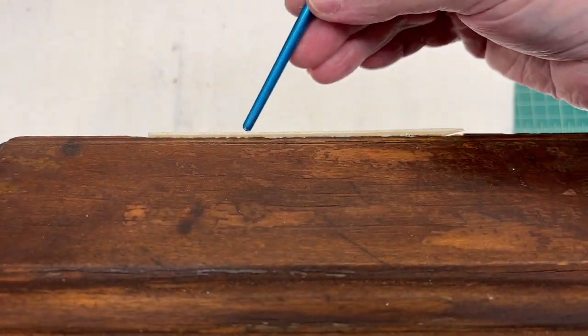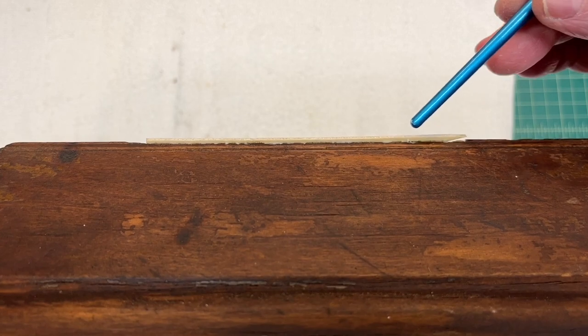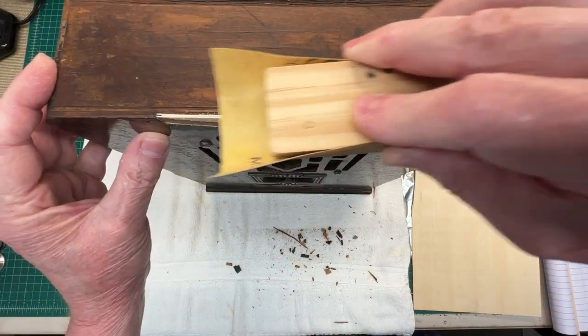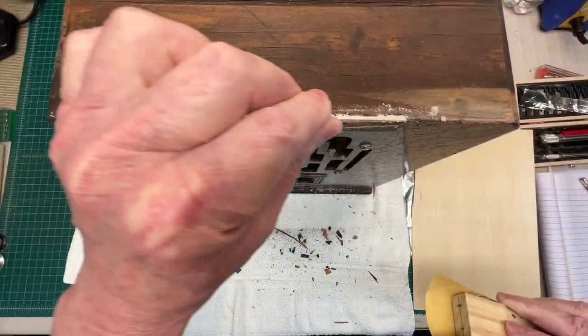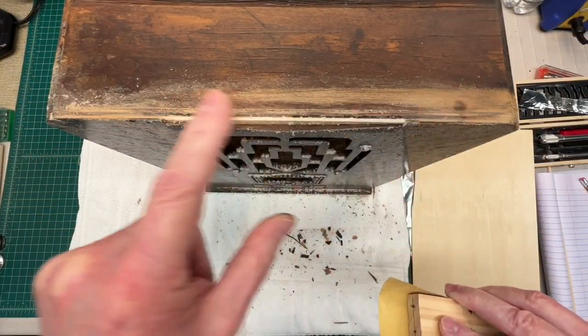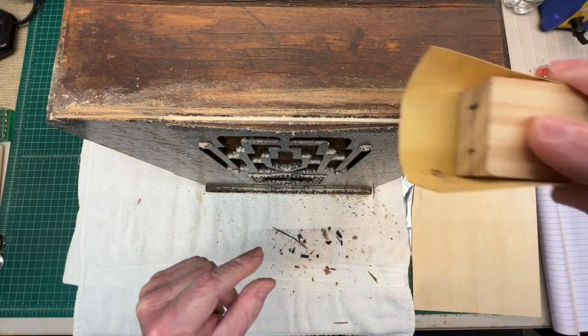As you can see, I left the piece a little taller. Once the glue dries, I'll go back and sand this off with some coarse sandpaper. I've cut the height down to just about where I need it because I'm starting to sand into the existing finish.